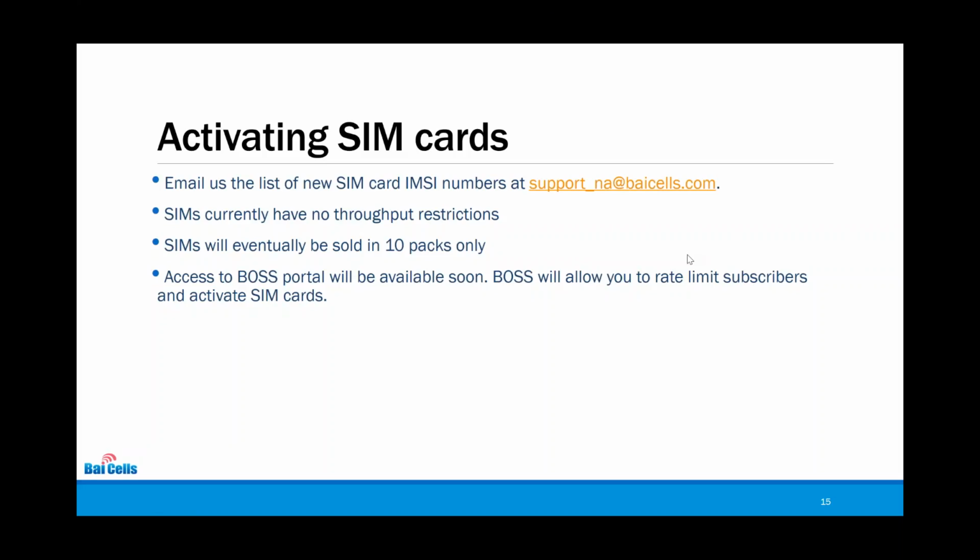Max number of customers you can have on each sector. So technically, and I'm trying to remember if the next software is coming out, but basically the most that would ever be supported on our base station is going to be 96 users. I think for most operators, if they're doing 10, 20 meg download packages and you figure out your oversubscription ratio, you're usually going to be around 40 or 50. So it really depends on your internet packages, but if you're doing anything that's somewhat high, you're probably not going to want to add a whole lot of subscribers to each sector or base station.